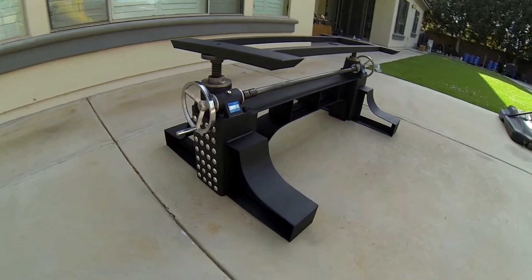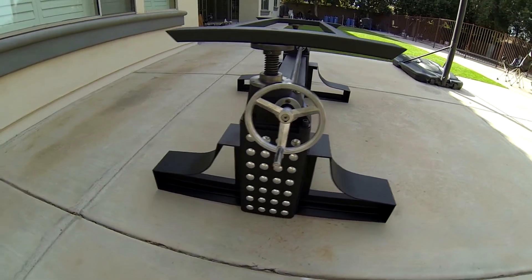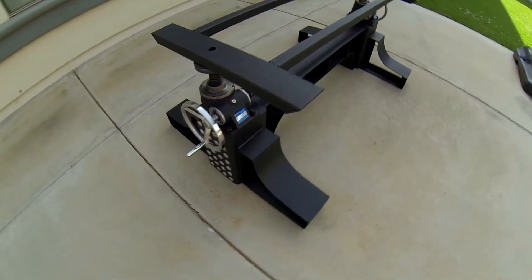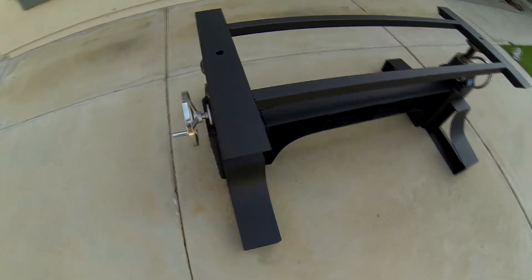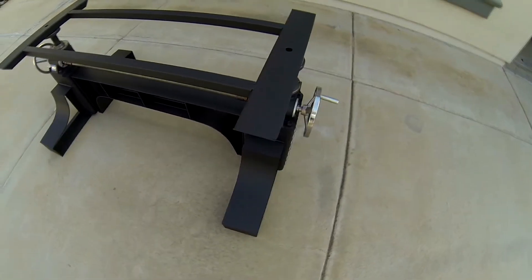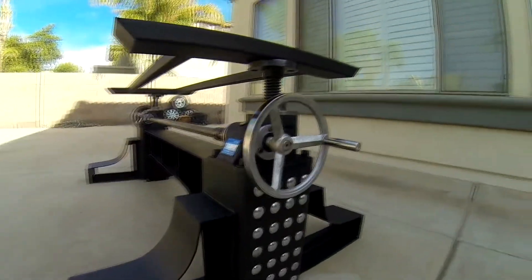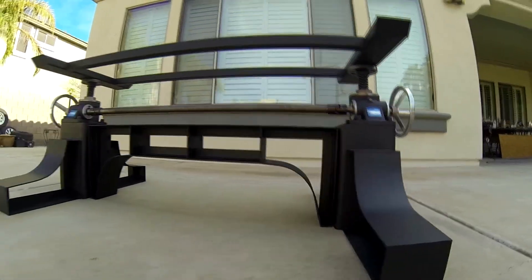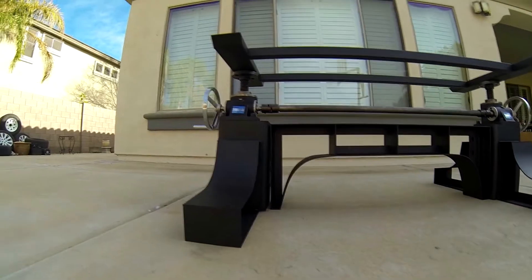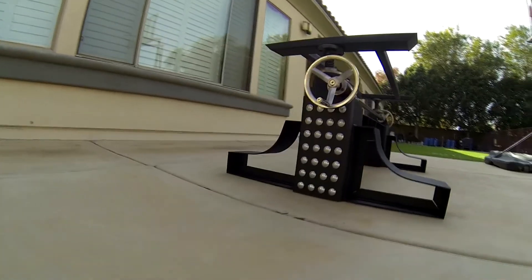In this video you can see the components. The center portion is not bolted on, but the end components there with the center column of those carriage bolts and the side supports are welded together. This top support piece will bolt right onto the bottom of the table and onto the top of the screw jacks. The crank will allow for an adjustment of plus 14 inches, minus 2 inches, so the table will be 30 inches tall at the top.